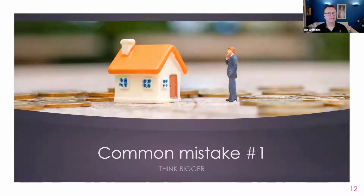So when you're testing the ring electrode, bear in mind that if your building is 50 meters diagonally from corner to corner, you're going to need to go 200 meters away to get outside the influence and get an accurate measure. On larger systems, for power frequency systems, I don't think we've done anything under 600 meters. Going up to a couple of kilometers is quite common as well.